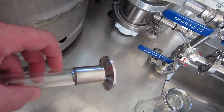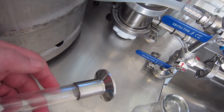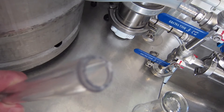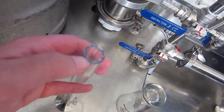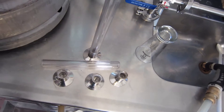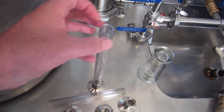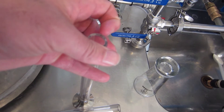I did a big teardown a couple of weeks ago, cleaned everything up, soaked my fittings in PBW, soaked the polycarbonate pipe for under an hour, rinsed it, and let them drain off. But when I went to put everything back together, one snapped off where the thread was, then another broke at both ends. Three breakages just before a brew day, all in the same spot — that can't be a coincidence. Looking at it, there are little cracks that go all the way through.